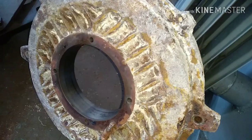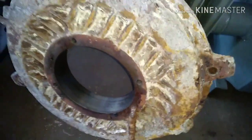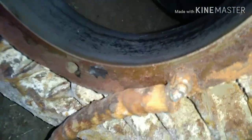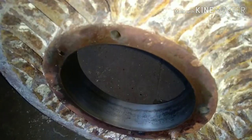You can see this is the fan, and behind it is the bearing and bearing housing. The BTD is mounted on the bearing housing. When the bearing is placed on the housing, all the temperature generated by the bearing is transferred to the housing, and from the housing it is transferred to the BTD. On screen you can see a bearing housing.